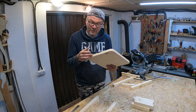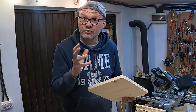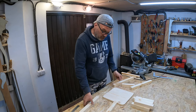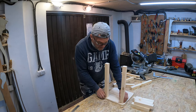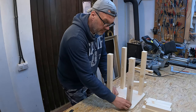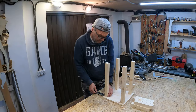The main satisfaction of doing handmade furniture is that you and only you decide on its proportions, how the knots are going to be designed. So, in the case of our stool, I'm not rushing to cut the upper and middle parts to the exact size, as I want to improvise and see. Firstly, place the legs. Look at what the indent should be, how it will look, how aesthetic it will be. Maybe they will be closer to each other, maybe a bit further. For example, even now, I see that it would be good to leave 2 cm for the sides.